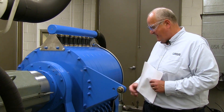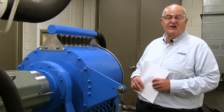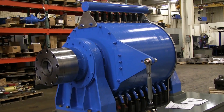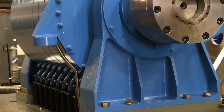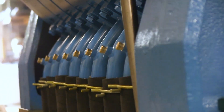The entire dyno assembly is connected to a sub base. The sub base is the discharge system for the dyno, so the water is discharged through the return ports or the exhaust ports into the sub base. The sub base has ANSI flanges that will be fed to a gravity drain system, returning back to the water storage reservoir for the cooling tower system.